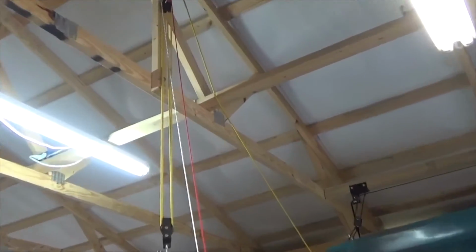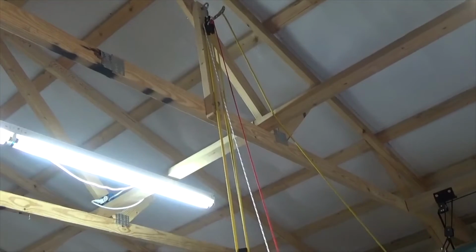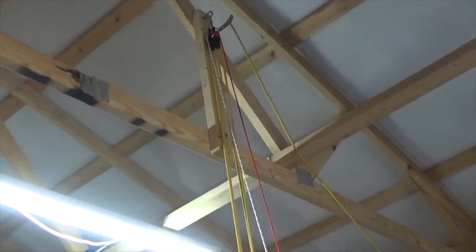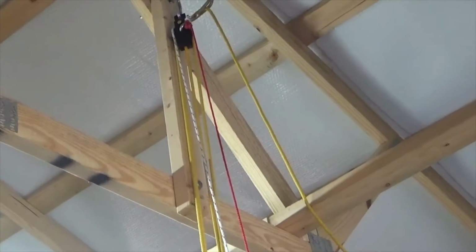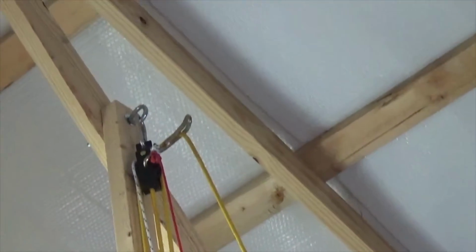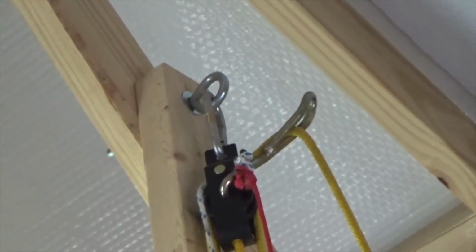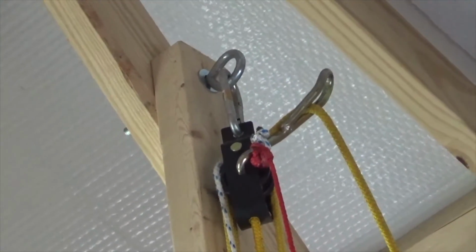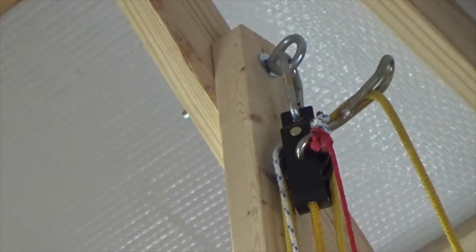We had to add a vertical 2x4 as a support that was attached at the top to the sloping roof rafters. At the bottom, it was attached to the horizontal roof joist. At the top, we drilled a hole into the sloping roof rafter and the top of the 2x4 support. Into this, an eye bolt with about 4-inch threads was inserted and bolted.